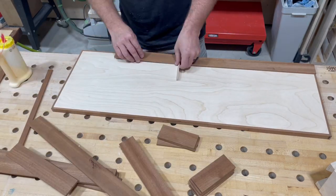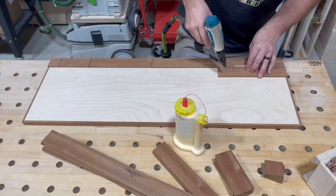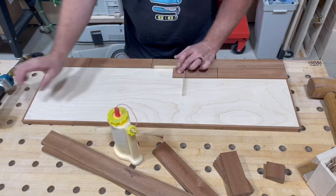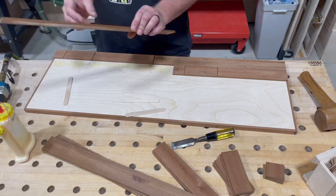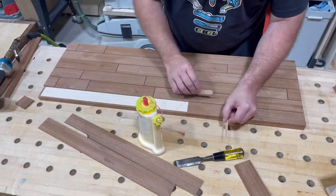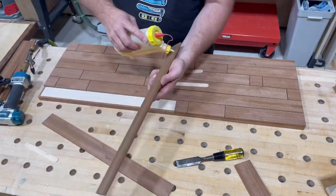Here's the repeating pattern I'm talking about. I use a long piece - about 18 inches - followed by a 10 inch piece, then a four inch piece, and then an inch and a half. I repeat that all the way down the line, but each successive row I offset the starting piece. If I started with 18 inches, the next line up I start with 10, then the next with a 4 inch piece, and so on. It ends up being a cool effect - it's random yet organized all at the same time.